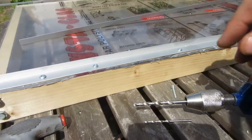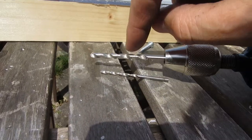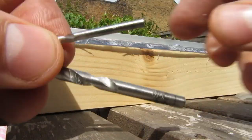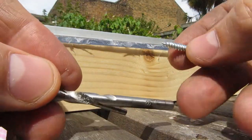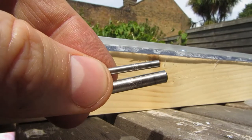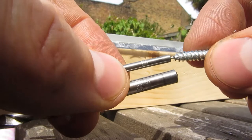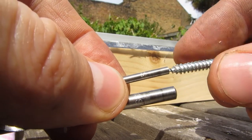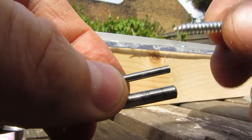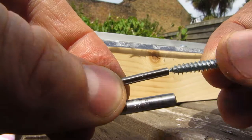So that means I've got two different drill bits. Here are the two different drill bits — this one does the tight hole, this one does the loose hole. If we put those beside the screw, you'll see we've got these two different sizes, and you can see the small one is thinner than the thread. It's actually borderline too big, but it's quite comfortable — everything's going in nice and tightly without having to screw hard, which is quite important.